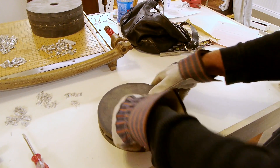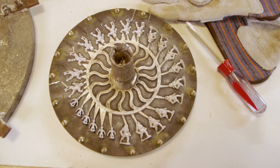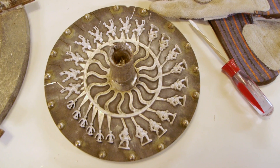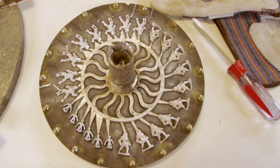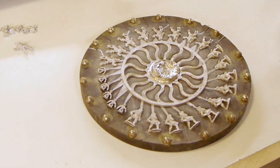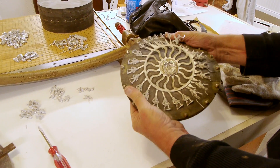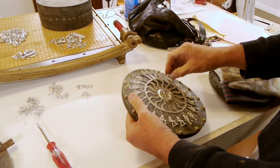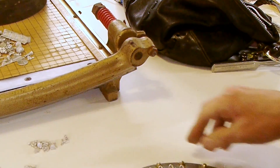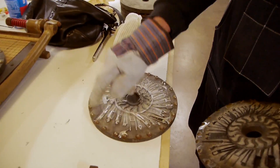Let's try another mold. This one makes Dungeons and Dragons figures — those were quite popular back in the 70s. We've got a couple of different knights and a little diminutive lizard man. Everything cools off rather quickly — that's what makes it possible to cast molten metal into a rubber mold. These lead-based alloys cool very, very rapidly so they don't burn up the rubber. This technology has been around a long time and they've used it to make little tin soldiers and so on.